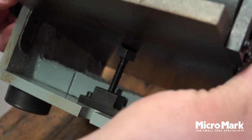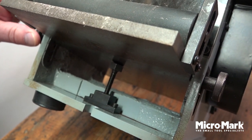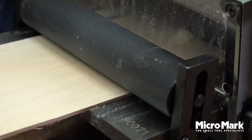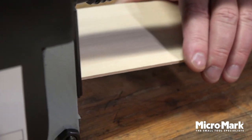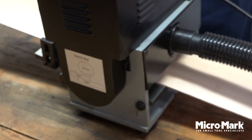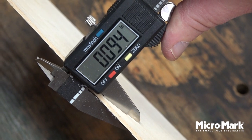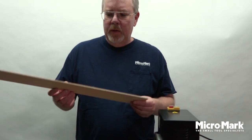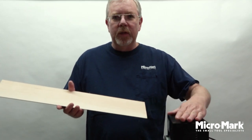I was at one hundred thousandths that I showed you earlier on my piece of wood after two passes with the one sheet, both sides sanded. So as you just saw, I was down to ninety-four thousandths of an inch — that's with a pass on both sides of my board. Six thousandths of an inch removed, and that's the way you make your adjustments on this drum thickness sander.